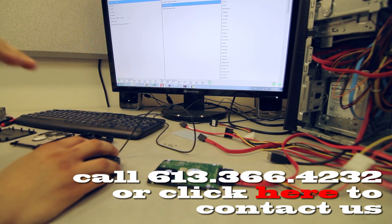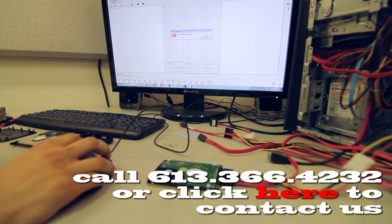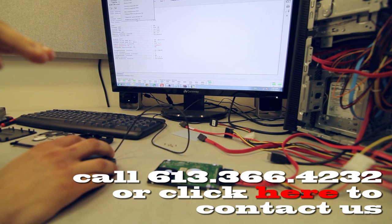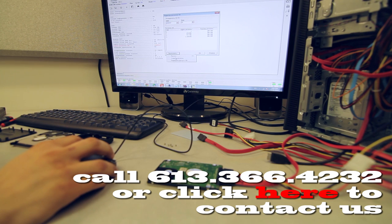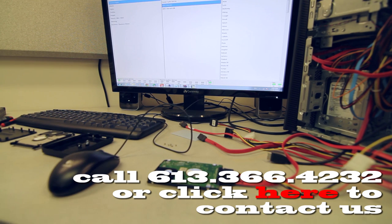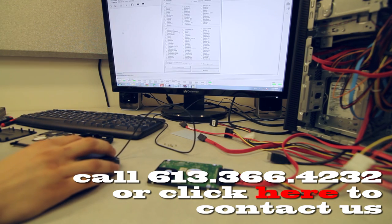Now that we cleared out that listing, the drive should be able to come up on its own, since our service area is still shifted. We're gonna shift it back. Power down, power up, and right now we should be able to get access to the drive's content and work with the service area. As you can see, it now lets us in and it gives us a full ID